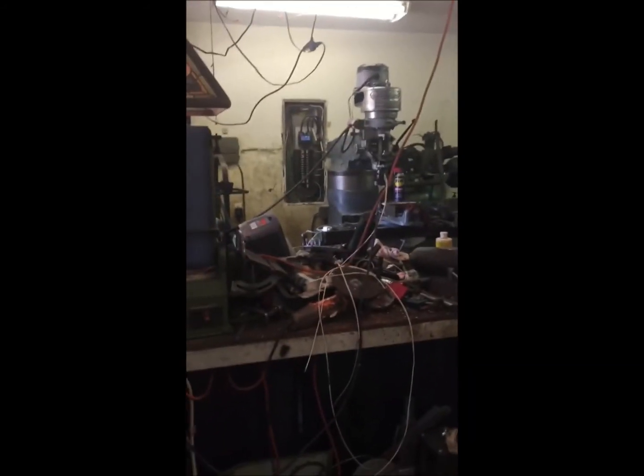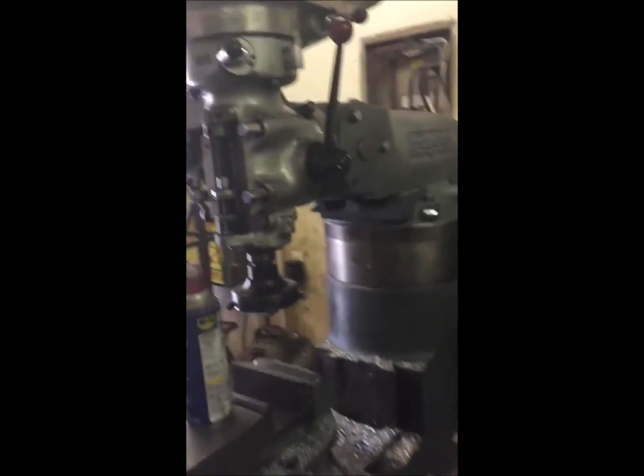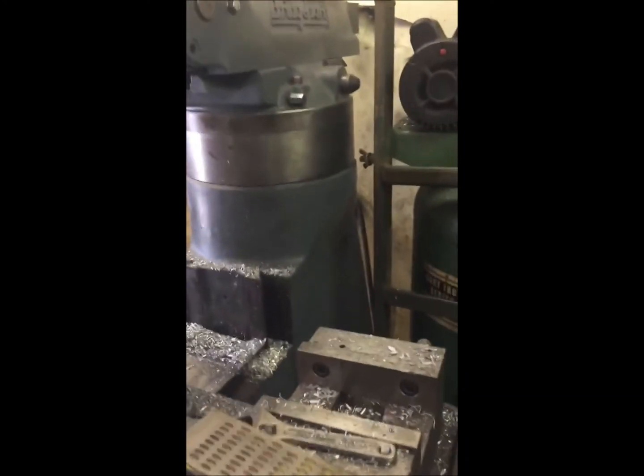That's 50-taper, and the head down on the floor is 40-taper. I don't know how much I'm going to use this in the vertical sense because I already have a good vertical mill — the Bridgeport. I just got done rebuilding everything on it. I still got some bugs to work out, like the motor — it needs to be fixed. I still need to get the covers and wipers done to tidy it up. But it's coming along — the head doesn't make any noise. The motor is shot but it's still usable, so I just take light cuts.